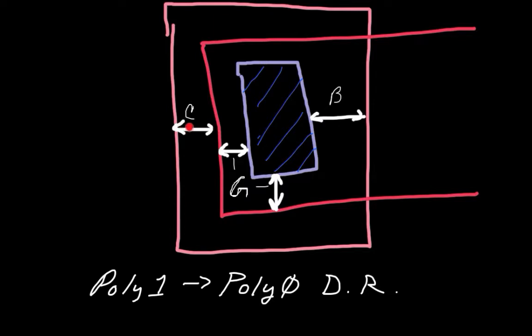This design rule is the same as what it would be here on the other side — a lot of students forget that. They'll put five microns there and forget about this and it'll be coincident to this side. So that's a design rule error.